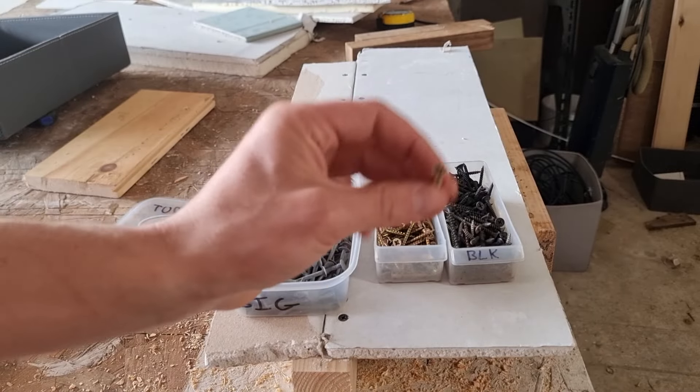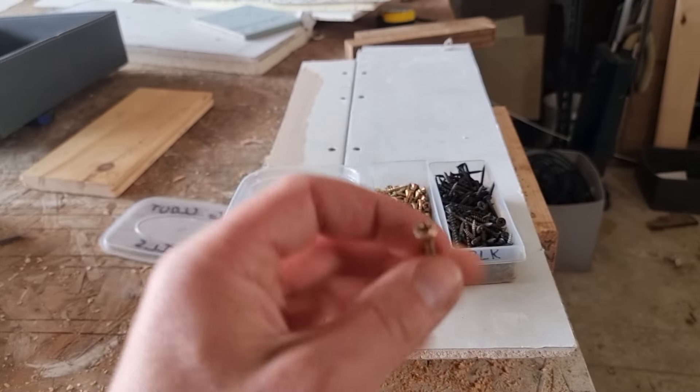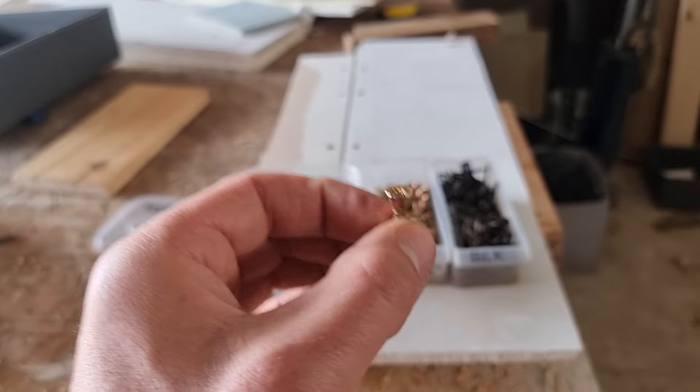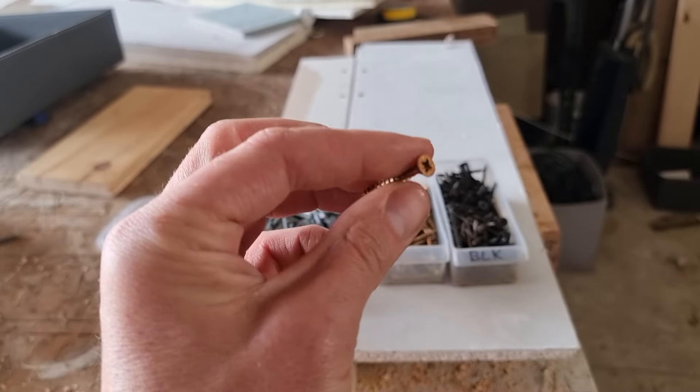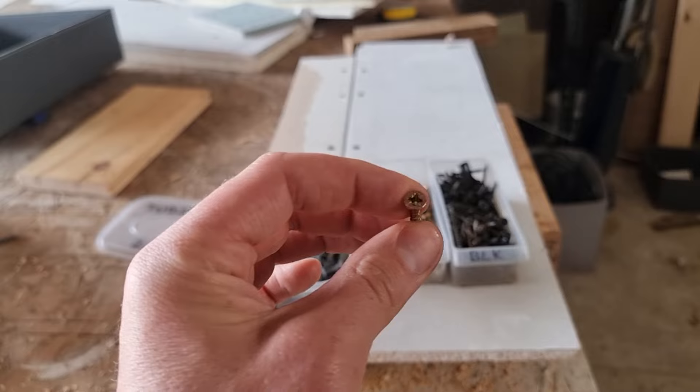One important safety warning: never ever use wood screws to fix drywall. Wood screws exposed to moisture will start to rust, and once you've finished taping and jointing your plasterboards, if the screw does get rusty it could show through your paintwork.